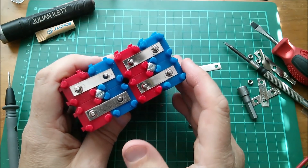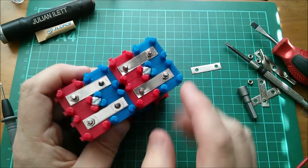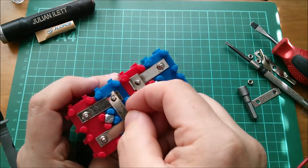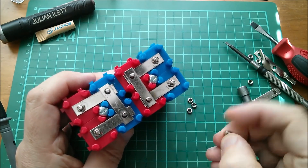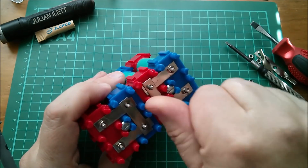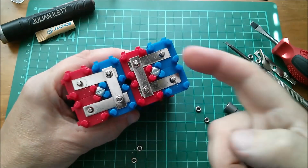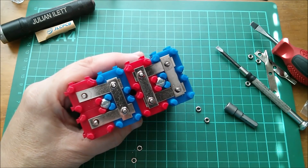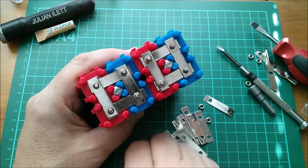Now we've got to be a little bit careful here. One thing I absolutely definitely do not want to do is strap across that gap because we're strapped across that gap on the other side — that would go bang. But we're OK strapping across here and here for my parallel connections. And I'm going to take these four nuts off as well and make another parallel connection across there, so I've just got the maximum current-handling parallel connections made. These nuts are really very fiddly, but the nut spinner helps you get them on. Nothing's exploded yet. This is all one connection because it's all one piece of metal, so clearly nothing untoward is going to happen if I strap across there because it's already connected.